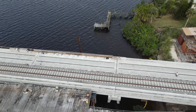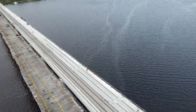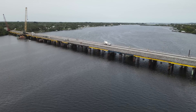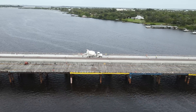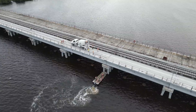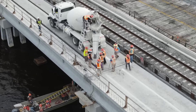Looking down the bridge, this concrete was poured directly into the gaps between the beams. A previous pour had ended here. A little while later, the ready mix truck had backed out on the bridge and was beginning to place the mixture. Unlike standard concrete, which flows out in a lumpy, liquidy slurry, the UHPC comes out in a more putty-like flow.